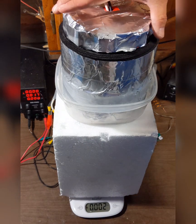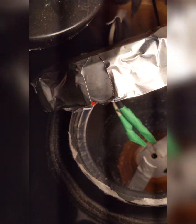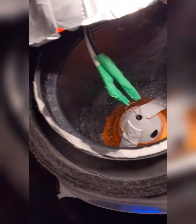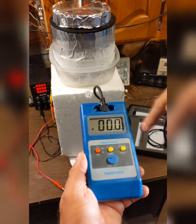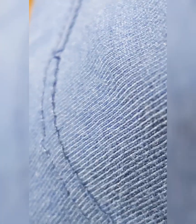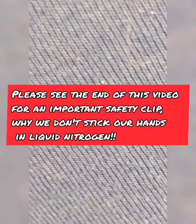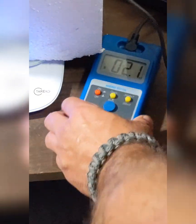It's going to boil the nitrogen a little faster because it heats up, but I just want to show you the inside — you can see it's bubbling away. For the sake of being thorough, I'll do a magnetic field test. At 10 amps I'm reading 2.2 millitesla at the bottom, and 4.5 millitesla coming out near the top.